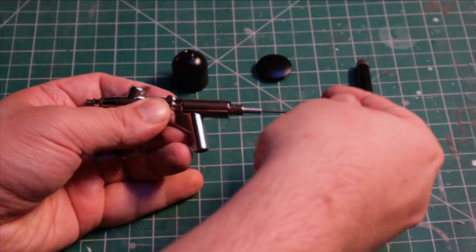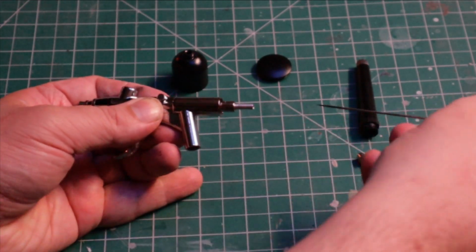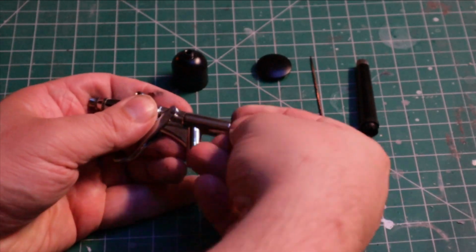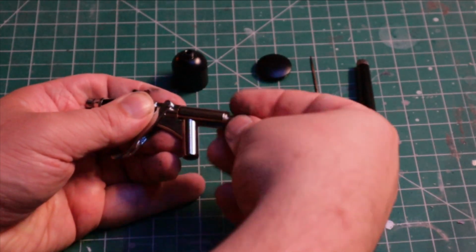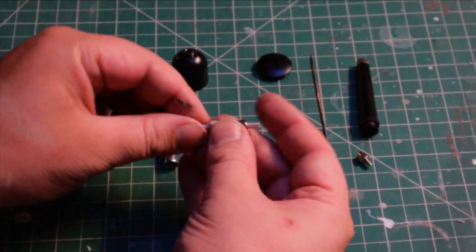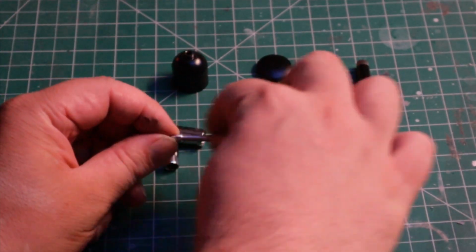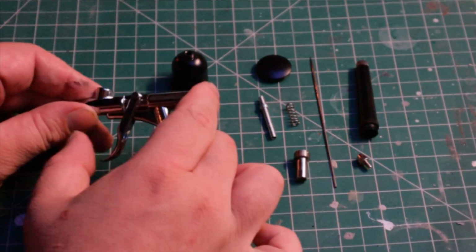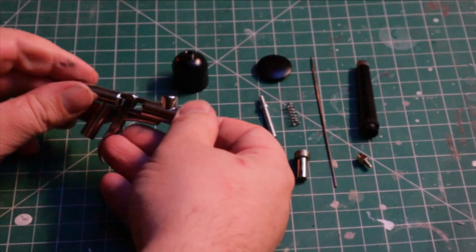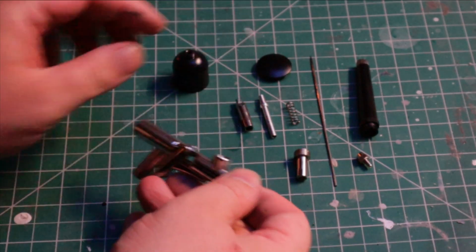What differs from the standard Hseng pattern is the lid is threaded rather than slot fitted. The nozzle slots in and is threaded down by the crown cover, and the trigger does not protrude down to the air input, and there is no air valve at the bottom of the input. Remove the needle first and everything else is straightforward.